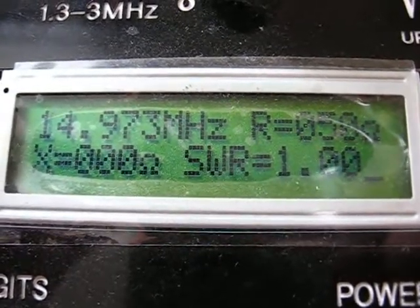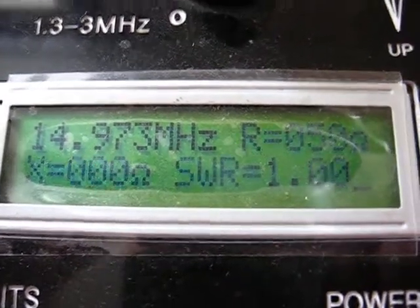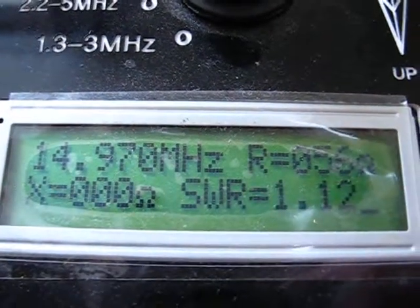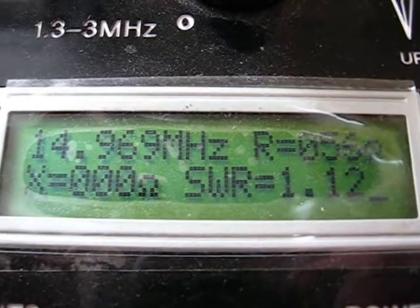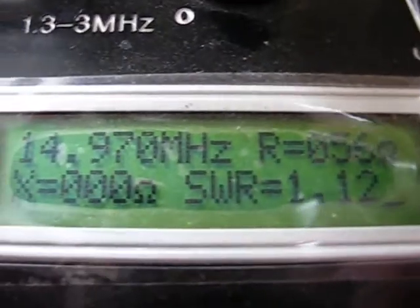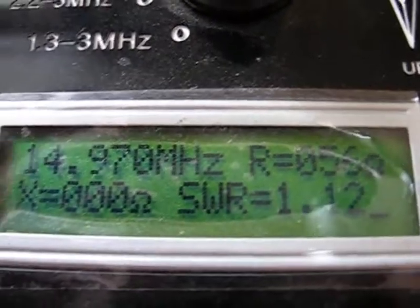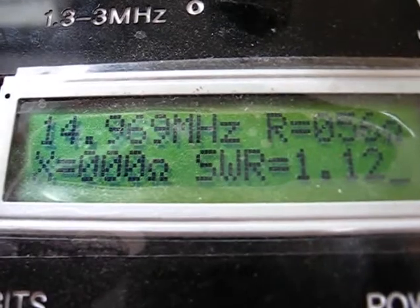Right, well I'll nip out and snip some bigger folds off — at least I've got the size to play about with. As you see I haven't touched the meter, because it is running off a power supply since I've been out. So I've had another three feet by snipping the folded-back wire, so it's gone up to 56 from that 50 ohms. So we go down now.